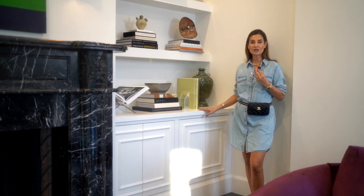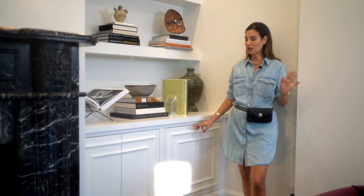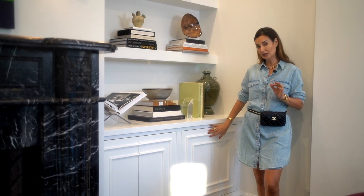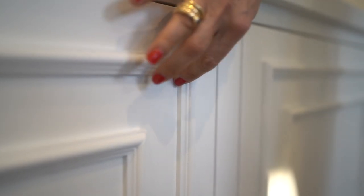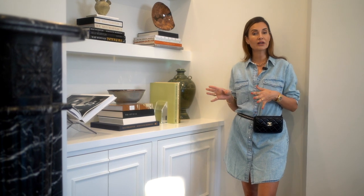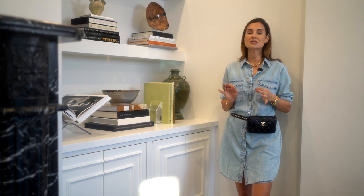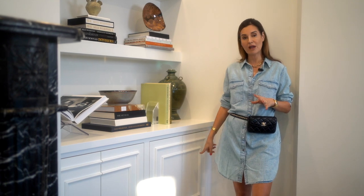First and foremost, this was built by a very skilled carpenter, and the door fronts were made with flat MDF. You need to use flat MDF in order to get the right finish for your cabinets. Then we applied a special molding, which we call the Neenah, because I designed it myself. If you're in Los Angeles, you could have this made by me, or you can try to mimic it. This molding is no more than half an inch max — you don't want to go more than that. It's applied on top of the MDF and then was cut right in the middle, so these were applied after the fact.